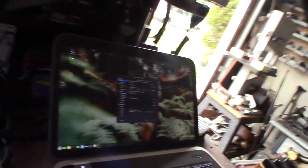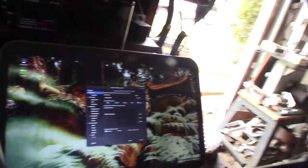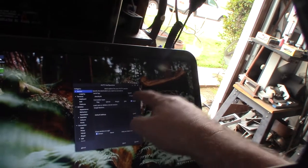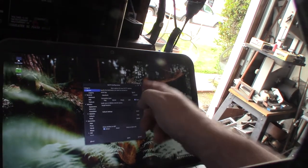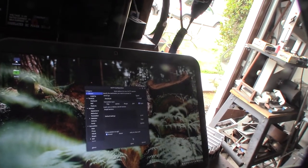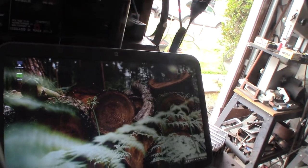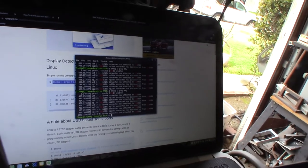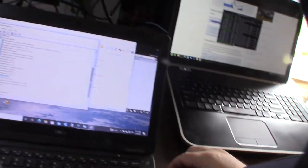Here's my Linux-based laptop that I built specifically for this project. I'm going to try to get PuTTY set up. With a typical Cisco router the baud rate would be 9600, but most OpenWRT boards go at 115200 baud. I'm going to open the connection to the serial port — but I couldn't get this adapter to work correctly in Linux. I could see it on the bus but couldn't get any terminal program to communicate, so I fired up my Windows laptop.